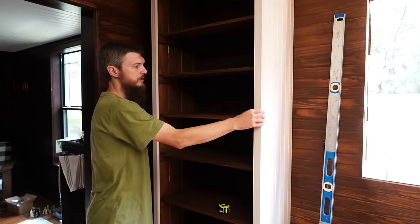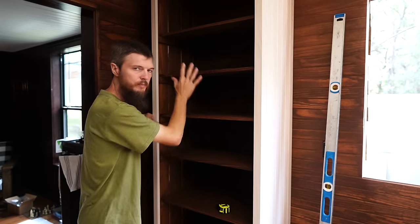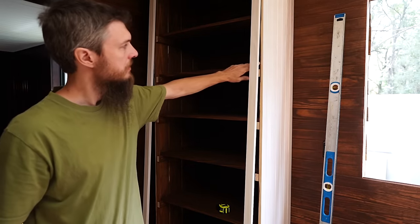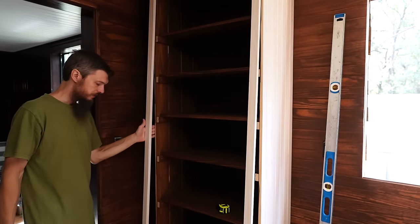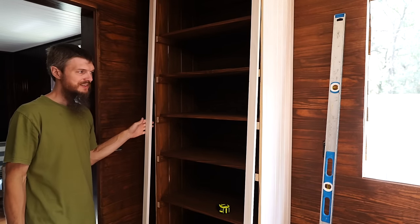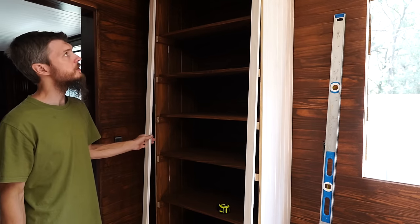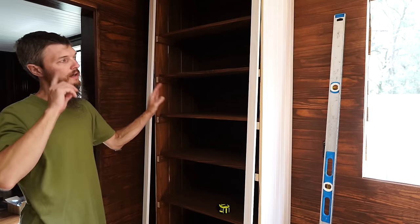And this is going to be where the cabinet doors attach. So you won't be seeing this brown when it's all closed up. I'll probably just finish nail that right to the face of this and then we'll hole fill. I'm only waiting because I'm gonna be adding one more piece of wood over here as a spacer. So I'm gonna get my spacer ready just to push it off this wall a little bit. Once I get that attached, we'll get this all secured. Then we can slide the cabinet into place and secure it.